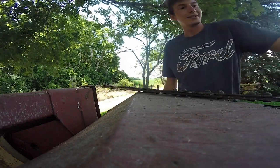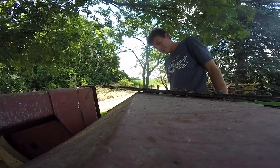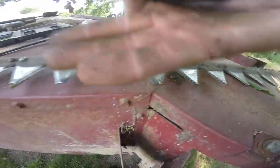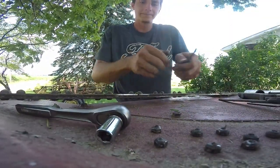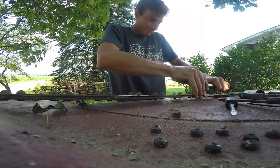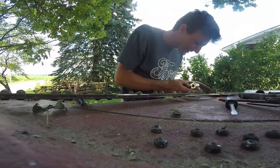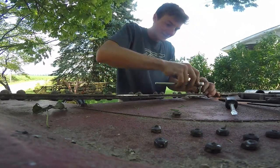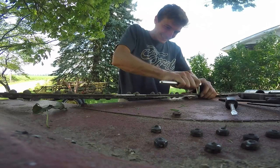This is what I broke. Since dad's getting more — should be getting more, I hope — if not I got a spare sickle I can dissect. I'm going to put a good one from somewhere out here in the middle back in this place and get this all tightened back up so we're ready to go. This one's sharp but we'll leave this one — I don't need a good one right there. Carefully tighten, don't break off the stud.